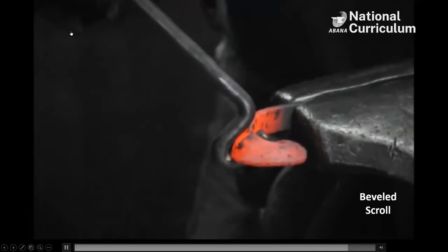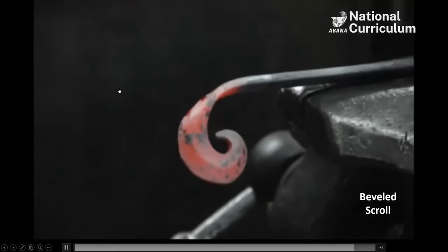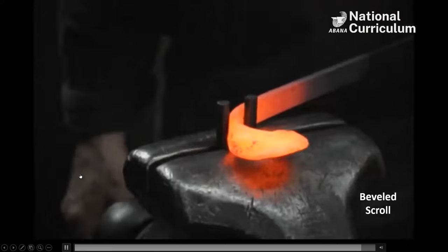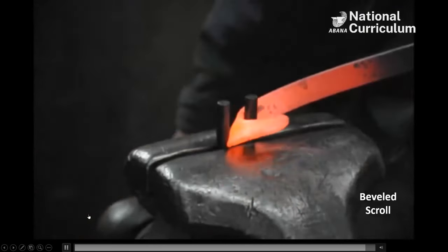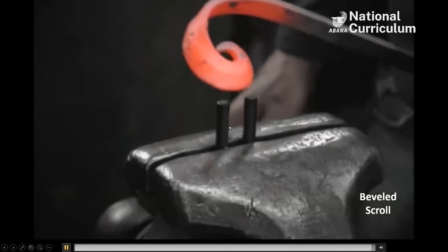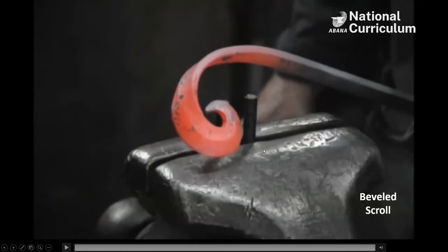That's for me — you have to figure out what works best for you, maybe you're better with a mallet. I know Mark Asprey used a mallet. With that little U-shape or clamp bending fork, you can still get this into the right shape. And again, if you're turning where the ridge is, make sure that the edges of your bending fork don't hit the ridge, otherwise you get an indentation there and you'll never get that out again.